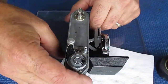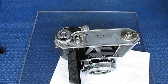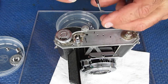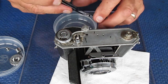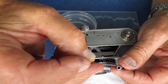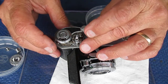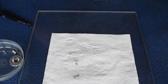That's all working nicely. This camera only lacks the top cover now. We can pop in place the film release button. The spring drops down the tube there. The film release button doesn't really need much lube — I normally just give it a wipe on the inside surface with a bit of molybdenum so that it slides smoothly. And that's it. Pop that camera to one side because we've got to clean up the top cover — we're just about done.